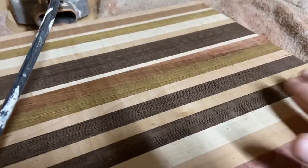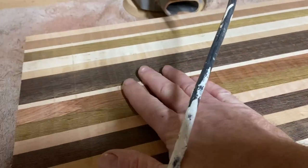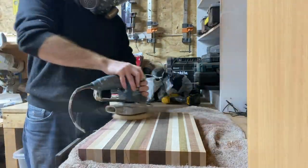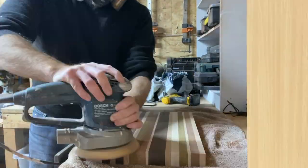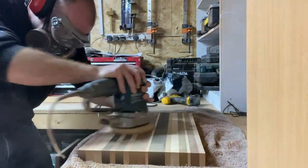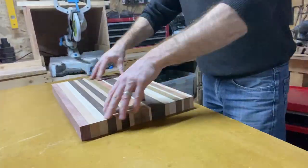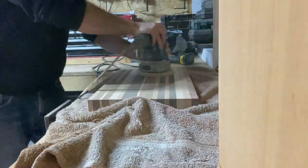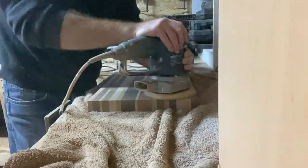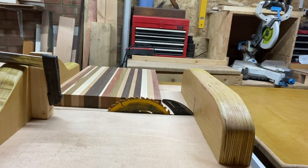You can see it kind of leaves these little ripples, but it's not — it is very flat at this point, you just need to sand them out. I get the orbital sander out and give it a light going over to get rid of those tiny router bit ripples. I'm going over with about 80 grit, fairly coarse, so it removes enough material and you're not spending all day doing it. Then I bring it over to the bench just to make sure it's nice and flat.